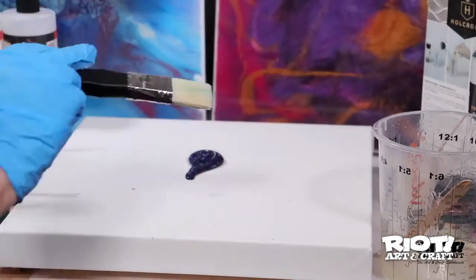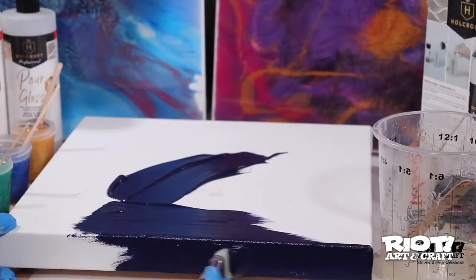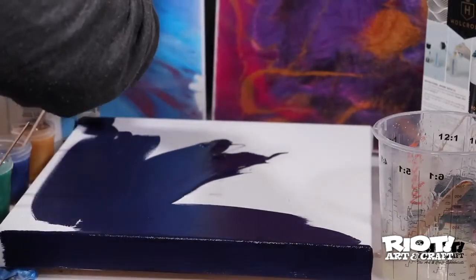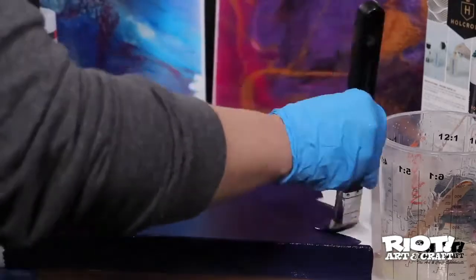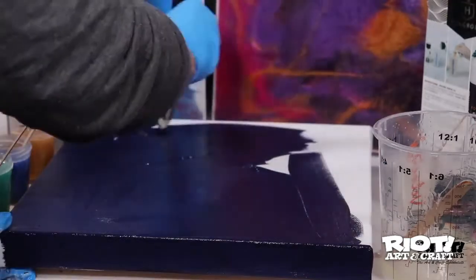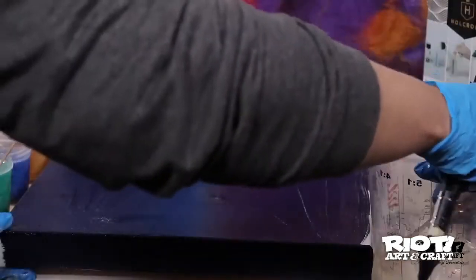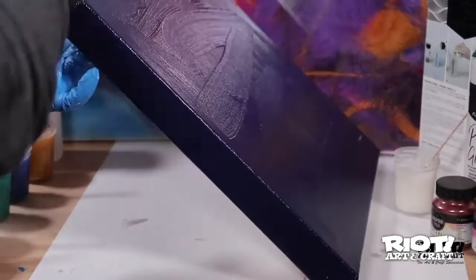It is also recommended that a disposable plastic or paper drop sheet is laid underneath the surface being poured, as drips and overflows may and will occur. Always make sure the surface is almost 100% level as possible. You can try and do this with a spirit level in the preparation process. A level surface will help spread the liquid evenly and get the best finish without the liquid moving to one side and dripping off.